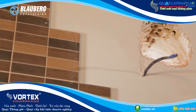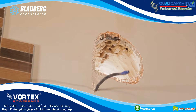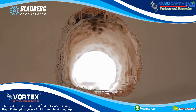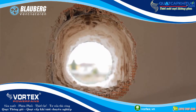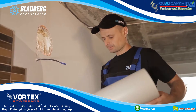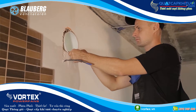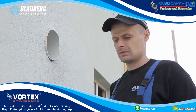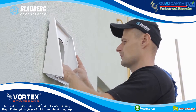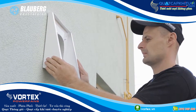Ventilation unit mounting: Prepare a round core hole in the outer wall. For core hole size, refer to the operation manual. While preparing a core hole, it is recommended to make arrangements for layout of the power cable and other cables for electric connection. Prepare an air duct with a length to protrude 3 mm from the wall or to be flush with it. Insert the air duct with a minimum 3-degree slope downwards towards outside. On the outside wall, the protruding part of the air duct must be cut to install the outer ventilation hood.